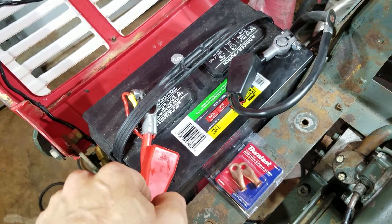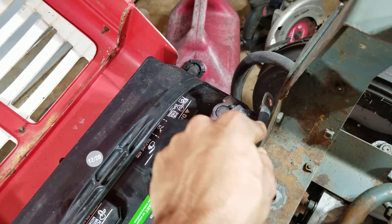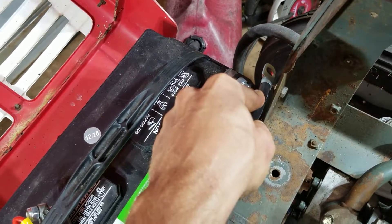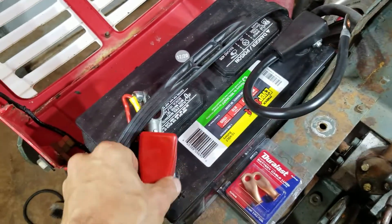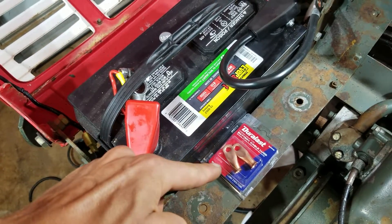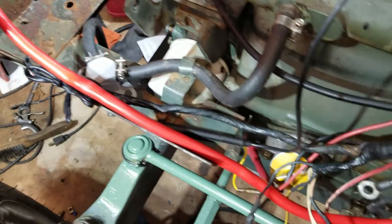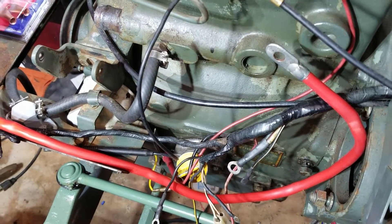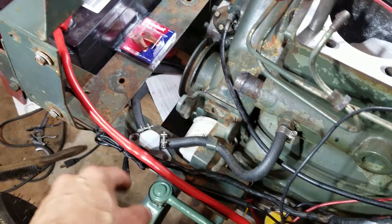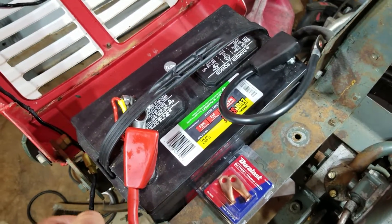Let's check out the new battery setup. Here's the new battery I got — I got it set down in here. The positive's on this side, the negative's on this side, and the negative is just going to bolt on this bolt right there. I got a lock nut so it can never come off, and I got the rust all cleaned up. It's got nice covers to prevent sparks. I got some new lugs in case I need to shorten up some of these wires. Basically it comes over and bolts up to the starter right here, then it's going to be all zip tied nice and pretty — you'll see it on the final rebuild video. These are number two gauge wires and they should be nice and thick to get this tractor started.